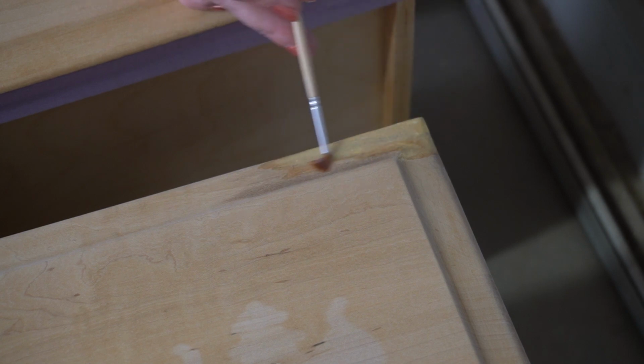I needed to tone the new corner patches, and I used acrylic paint for this. It dried flat and I applied a very light coat, but I didn't want it absorbing the stain all weird, so I did add a light layer of glaze. That will act as a barrier on both of the corner repairs. I left it to dry overnight and prep was done!